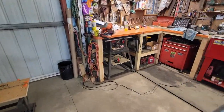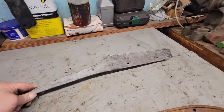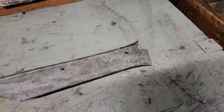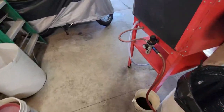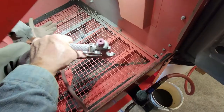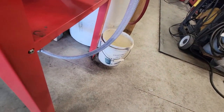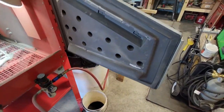I think I found the problem. I put it back in — this is the piece that I was just playing with before. There's the back side of it, it was all rusty. I finally got it pulling some decent media up. I changed the tip in the gun. I went with a bigger tip, and what a difference. You can see where the media is at right now — it's right here. Before it was clear down here somewhere. So it's pulling it up really well.